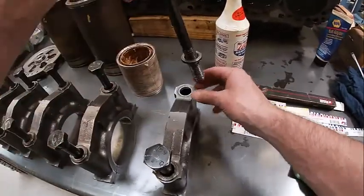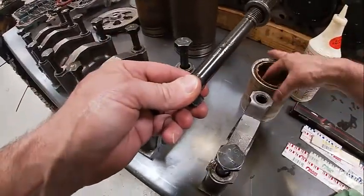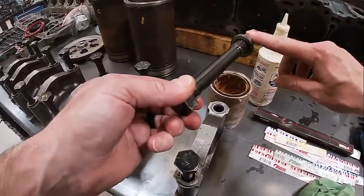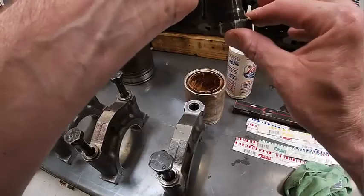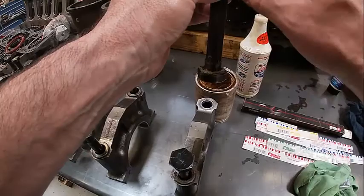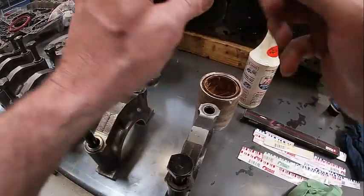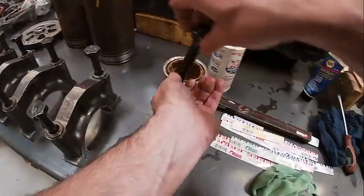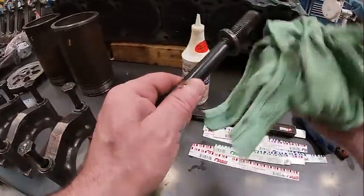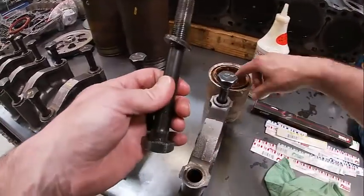The next thing we're going to do is put what we call peanut butter — what Detroit calls it. We're going to put some on the threads like that, then come up under here, under the head — that's the most important part. Put a little on the washer as well. Do the same thing on the other one; make sure it's good and clean. This one could have been washed a little bit more, but it's clean enough — no dirt on it, mostly oil.